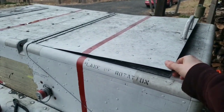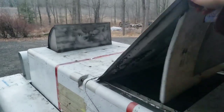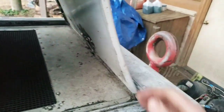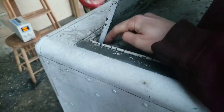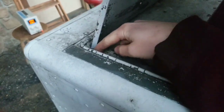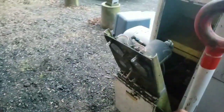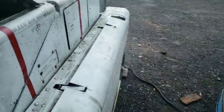When you open the inlet, the exhaust mechanically opens as well — it's kind of cool. Also, there's a safety switch that kind of tricked me for a while because I couldn't get this thing to operate correctly — couldn't even get the lights to come on. There's a safety switch underneath here that a pin pushes on. Without that safety switch actuated, nothing on this panel will get power. You can't even run the thing without that safety switch on.